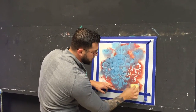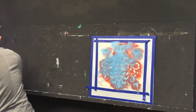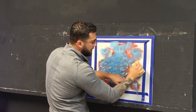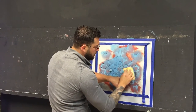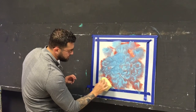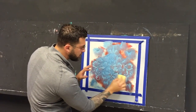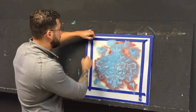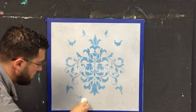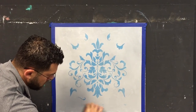One of the main reasons we're showing you this is because you could do this beautiful look on top of a Marmorino. People are always scared to do stuff on top of Venetian plasters — they only want to do it on top of flat finishing or on top of paint. But it's very simple, and if you do mess up you can lightly sand it on the edges to take off the pattern, because the Marmorino just absorbs it. We're going to take it off — it gives a nice little pattern. And here on the side, we get a little sand block and it cleans right out.